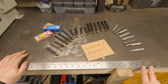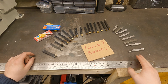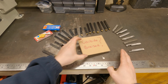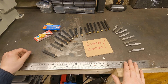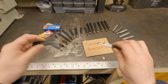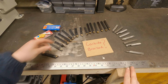You're going to need to know what tools are going to do what job. Today I'm going to cover all the tools that I think you're going to need to start off with as a basic — you can always grow your collection from there. Let's start off by talking about cutting tools. There are three different types of conventional cutting tools we use on the lathe: we've got carbide insert tooling on the left, on the right we've got high-speed steel tooling, and in the middle we have carbide brazed tooling.